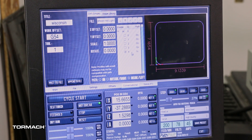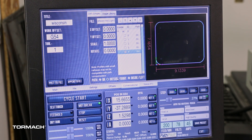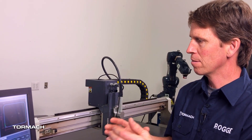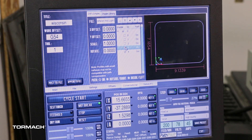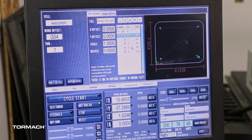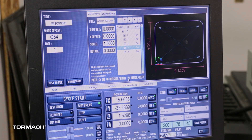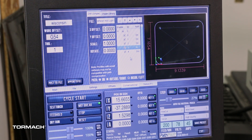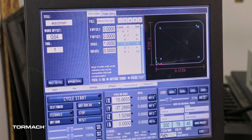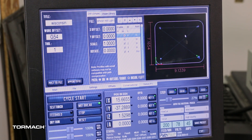So in this case, I want layer four to have an outside compensation, because I really want my piece to be the size I drew it to. And then on these layers — let me reactivate these holes — what I care about with these layers is that the hole is big enough. So in this case, if I cut on path, the hole would be too big. On these, I'm going to use the inside left compensation, which will make the actual path that the machine follows slightly smaller.